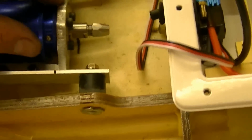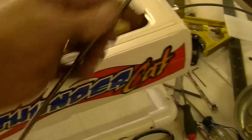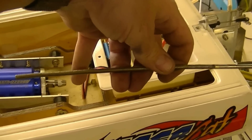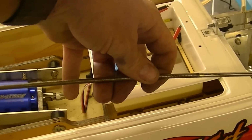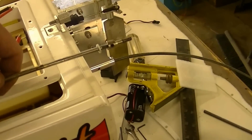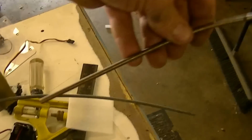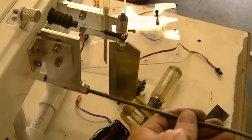And when you tighten up the things, what I've had to do, this is the stock flex shaft. You slide it in from the back, and if the motor collet right here comes loose while you're running, the boat slows down, and when it slows down, it puts drag in the propeller, which will pull this thing completely out of the shaft, and you lose it. It would just be gone, propeller and all. So what I've done is I'm going to convert to Octura 3/16 stuff,